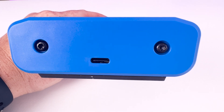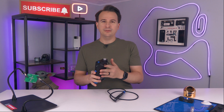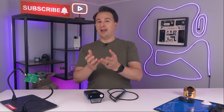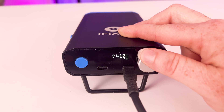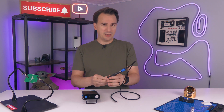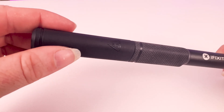You'll find three USB-C ports on this station. The single port in the rear is a 45-watt spot for charging the battery, and the front two ports are capable of a combined 100 watts of power delivery output. Why two? So you can actually plug in two soldering irons at once. With a click of this button, you can switch between the two irons, which is handy if you want to switch between tips. In addition to switching between ports, this switch serves as an on-off button and a menu interface. This dial lets you scroll through the menus and adjust the temperature of the iron. There's a handy little display to give you the current temperature and other messages, like a warning if you dropped the iron. You'll also find a handy kickstand and two mounting points for that magnetic cap. You can buy iron stands separately, but you won't need that with this one. And I just want to repeat — especially on this stand — the cap is so satisfying to use.